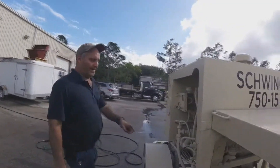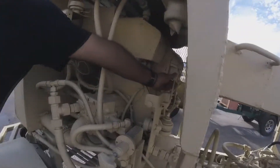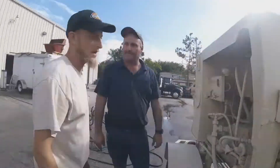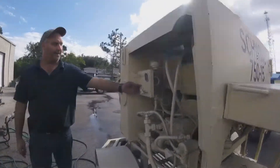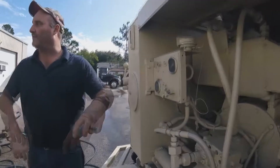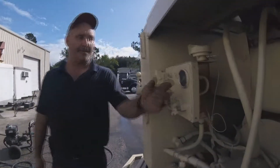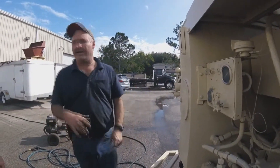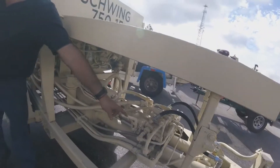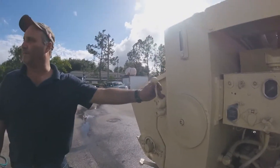When you're on the pump, you know about the flow control. You got rev up and down for the engine, and the kill switch — that's the choker to kill. This turns your main pressure gauge off here. If you blew the gauge and it starts leaking oil, you can turn it off. These are prone to blow out after so many years of going up and down. You also got forward and reverse here manually, and for the agitator: forward, reverse, and neutral.